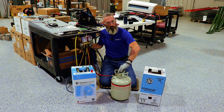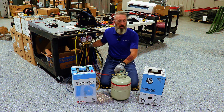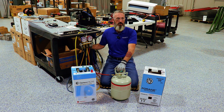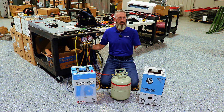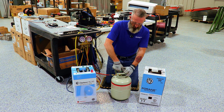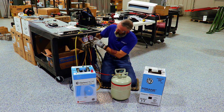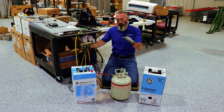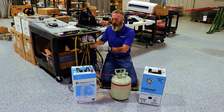In addition to the red stripe, you won't be able to confuse an A2L tank with a traditional tank because of the left-handed thread — basically lefty-tighty. They do that specifically for that reason, the same as acetylene tanks for torch kits, where the left-handed thread prevents you from accidentally attaching it to an oxygen line. On the refrigerant gauge, make sure you use a standalone gauge and read the correct pressure-temperature relationship for the refrigerant you're using.